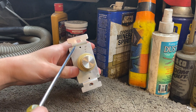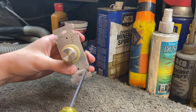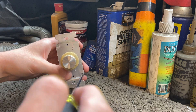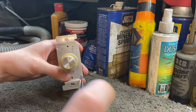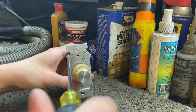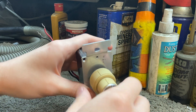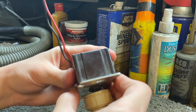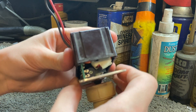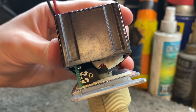You can see these two screws right here on the front of the control — just back those out. Those are the screws that hold the back cover on. Once those screws are out, just very gently pull the back cover off, and your trim pot is right there.